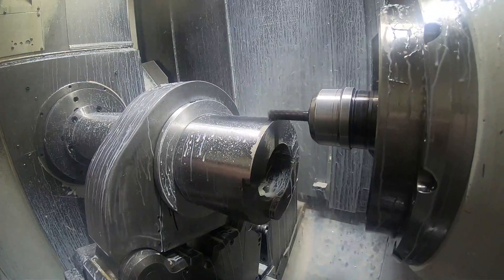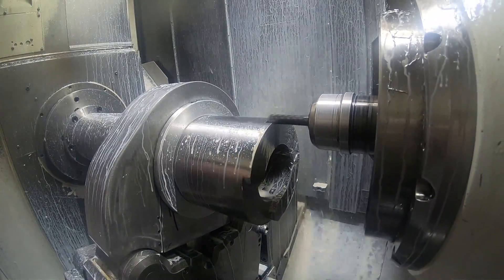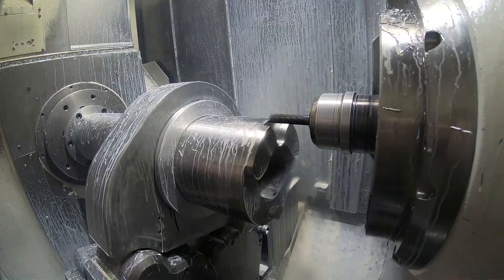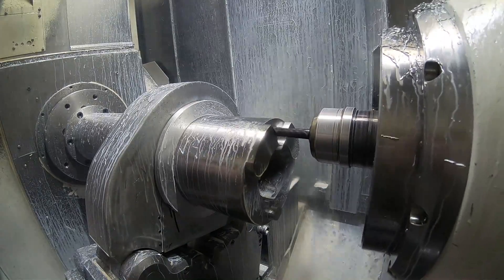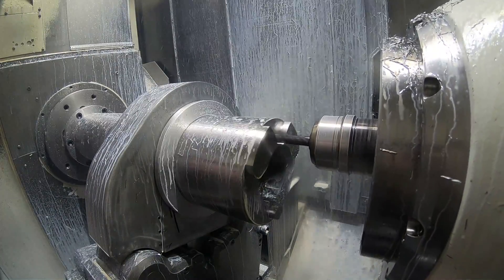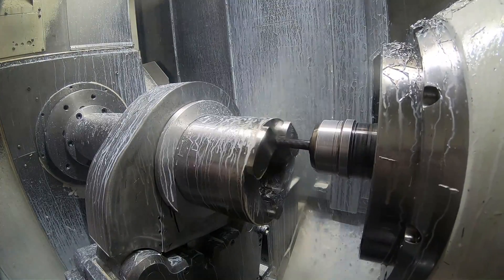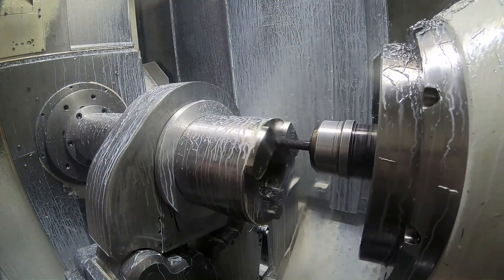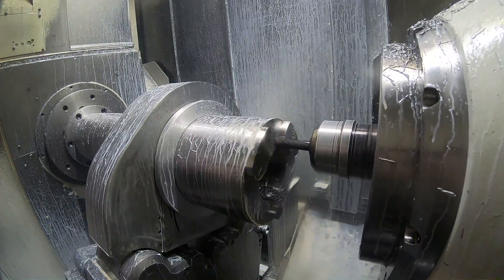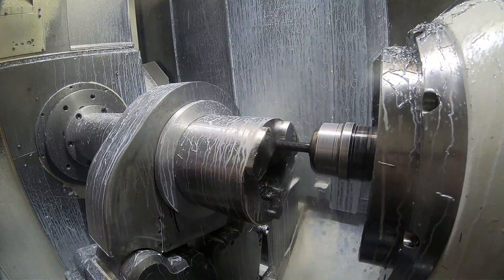You can see in this picture I did the adapter plate thing. It mounts onto the spindle adapter just the same as the previous fixture, so I didn't feel a need to go over that again. If you want to see that, you can watch that video. I skimmed the OD and roughed in the bore. I didn't show that in this video, but it's just a drilled and roughed hole, which I'm going to come back and bore later after I do this machine work.